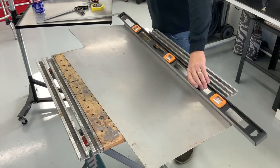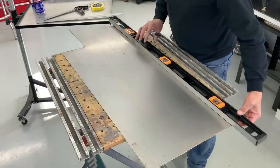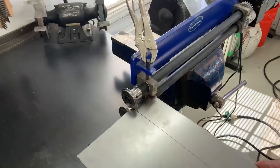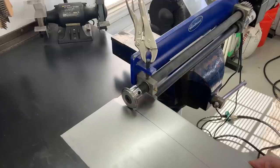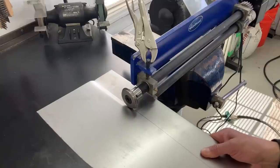As we did earlier, I took some measurements with our tape and marked it onto the new panel in preparation for bead rolling the joggle that we're going to put in to match the existing door. I don't want to have to make this door panel again, so I'm using a scrap piece here to get the joggle just perfect. I started with just a little bit of pressure and kept increasing it until I got the same offset that matches the door, as you'll see here in a minute.